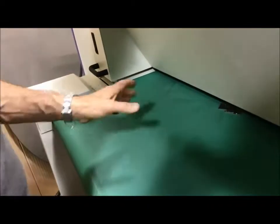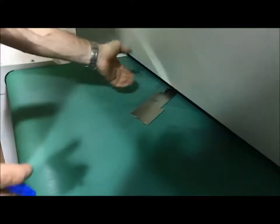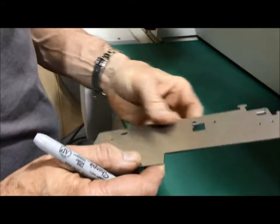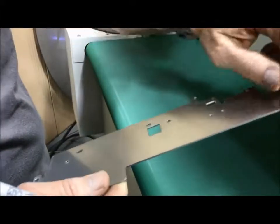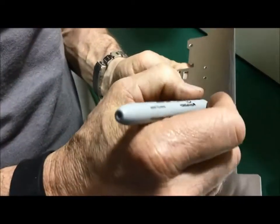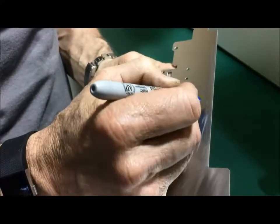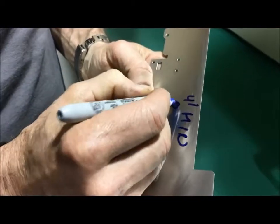And you can be the judge what is a better result. Sometimes more speed isn't necessarily a better result. You can save yourself a lot of conveyor belts and a lot of abrasives if you run them. So this is already, you will feel that. You see you hardly have a white line. It's safe for handling. You won't cut yourself, not at all, right? But you will see that the radius is way smaller, and therefore you have a crisper edge, not sharp, crisp. So that was 4 feet per minute. Medium pressure.